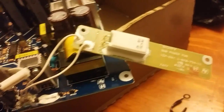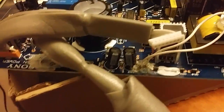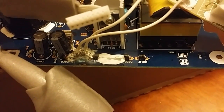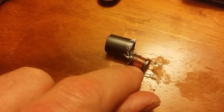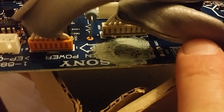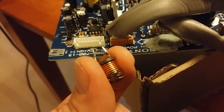Possibly three parts total that go bad on these, apparently. By replacing those two resistors — noting that mine has a separate board — and the capacitor right next to it, people are saying their Sony subwoofers are up and running again. And don't do what I did and desolder the wrong component. I read C858, then 859, and assumed that was 860, so I desoldered it. It came apart and it's just a coiled wire — an inductor — so I'm going to try to pop it back in and solder it back. Anyway, I hope this helps somebody.